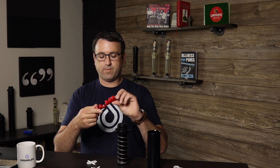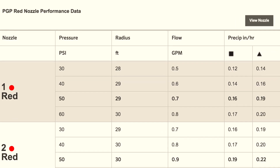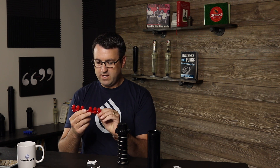Next question: how do the numbers on the nozzles correspond to the approximate distance? For this you're going to want to refer to Hunter's nozzle guide, which will tell you exactly the distance and the flow rate in gallons per minute that each nozzle can produce at a certain pressure. It's important to know your pressure as it relates to how far your sprinkler is going to throw and how many gallons per minute. At its most basic level, the number one nozzle will put out the least amount of water at the shortest distance and require the least amount of pressure, and the number 12 nozzle is the largest size nozzle that will throw the greatest distance using the highest gallons per minute and require the most amount of pressure.